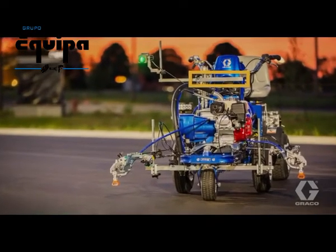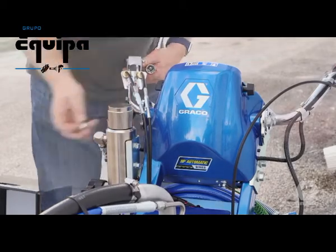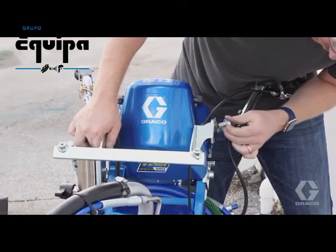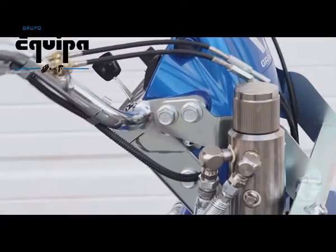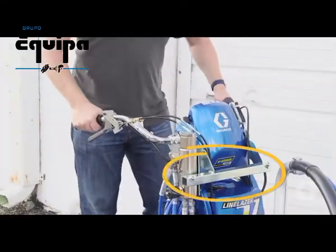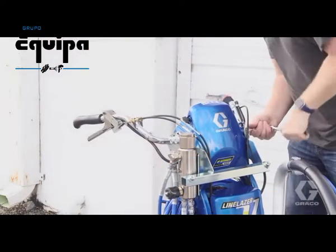Attach the laser mounting bracket to the handlebar. Start by removing the 4 bolts on the dual comfort handlebar system. Slide the laser mounting bracket into place. Replace and hand tighten the 4 bolts. Adjust the handlebars to your desired position and ensure the square tubing is level with the ground. Fully tighten all 4 bolts.